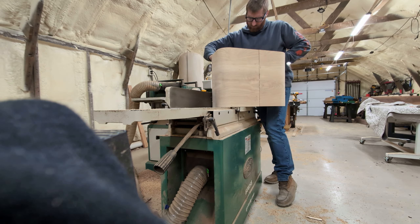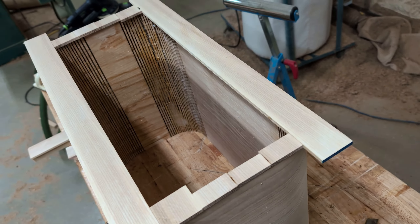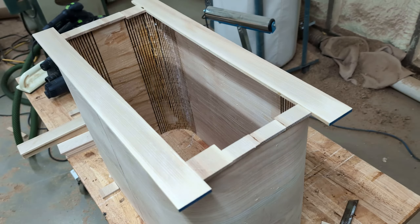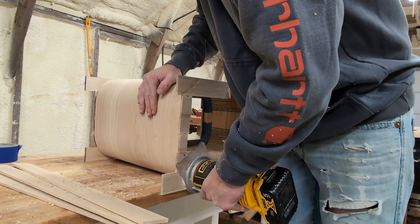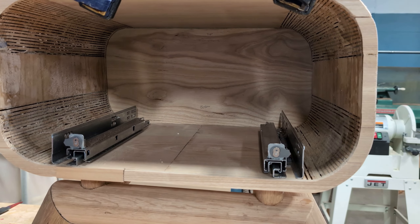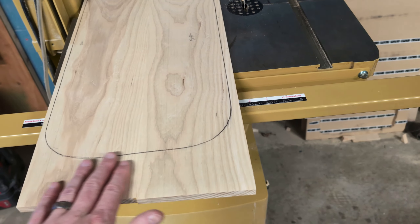Okay, back to Frankenstein. I'm using my jointer to get one side nice and flush, then I take it to my table saw and cut the other side so everything is nice and even, and then I start the edge banding process. I'm just using little pieces of veneers that I cut on my bandsaw and gluing them in place so that all my grain is going in the same direction and it looks almost like one solid piece was placed around the perimeter. I added some blue tape to the inside circumference of this nightstand so that my flush trim bit wouldn't transfer all those little curved ridges to the outside. I'm going with an inset drawer for this cabinet, so I put the face of the drawer up against the cabinet itself and traced it from the inside, and I'm going to cut out on the outer edge of the line and work my way up to it with the sander.